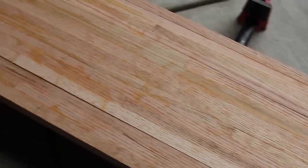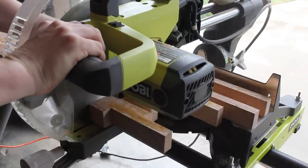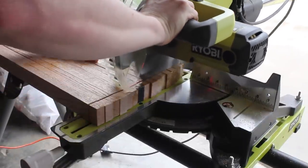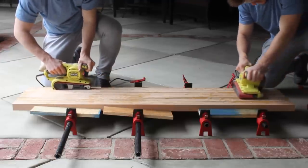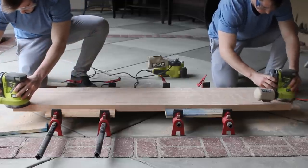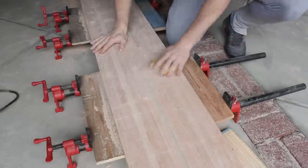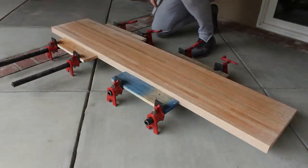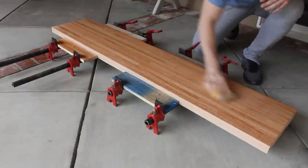The next day I went back to my miter saw and squared up all the edges. I forgot to use tape to avoid tear out, but I remembered right as I started cutting and took it very slowly, and it worked just fine. Since I don't have a planer or a router sled, I went with the more tedious way of smoothing this out — first with my belt sander at 60 grit, then 90 grit with my orbital sander, then hand sanding at 120 and 220 grit, followed by a wet sanding at 220 which raises the grain. I finished up with two more dry sandings at 320 and 400 grit, and by that point this thing was feeling incredibly smooth.